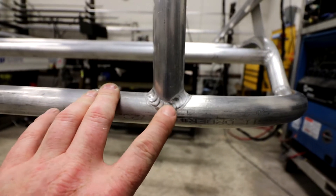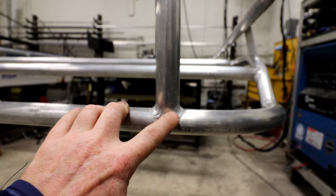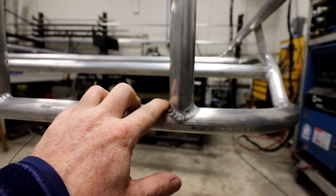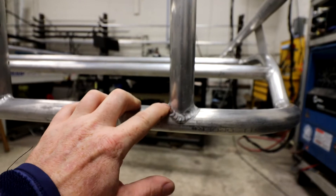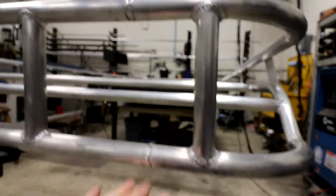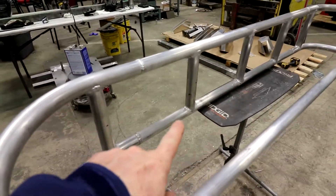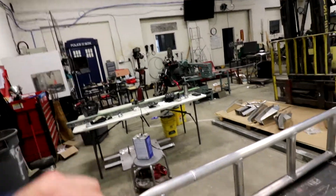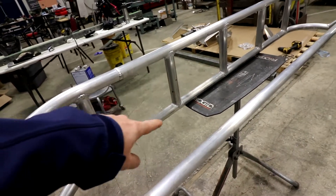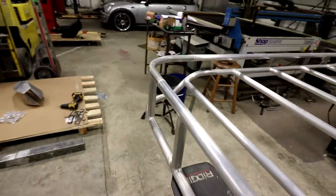When I had to weld these vertical pieces — straight up and down — that's a lot more difficult. What I did was turn the pulse off and weld at straight 200 amps, thinner here, wider there, feeding it in. Then I'd go back over it while it was hot and use the pulse — or manually foot-pulse — to dress it. For the inside welds I didn't have a lot of room, so I propped the rack up to weld in the air, and those turned out really nice on the inside.